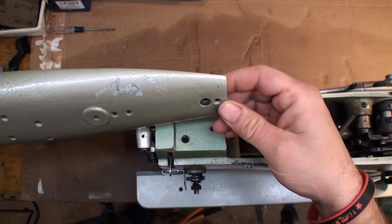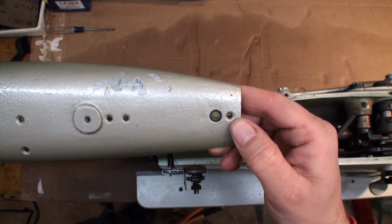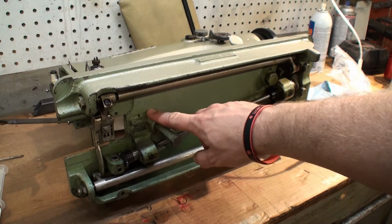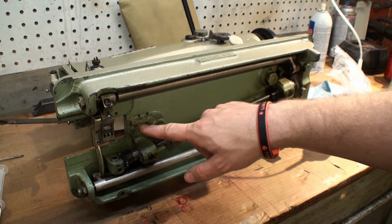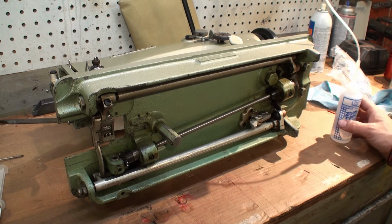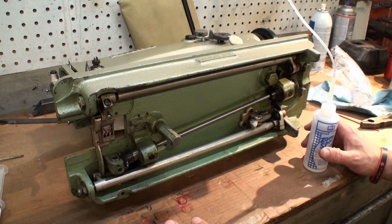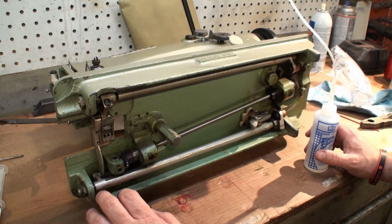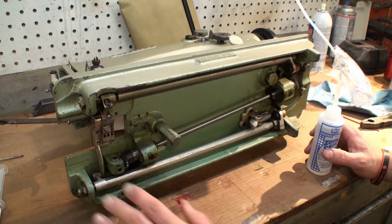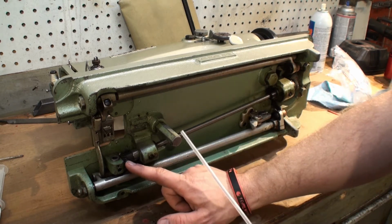Typically, we would just oil it through the ports on the top. Also ports on the machine itself in various places. There's ports that run through from the top so you can oil it. But as we said before, since it's the initial oiling, we'll go ahead and visually do it to get every spot that moves really well. The gears, we will do with the grease.